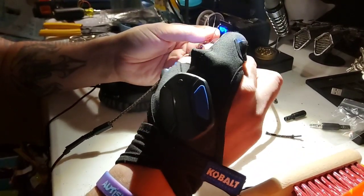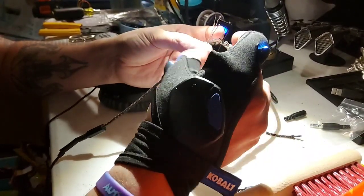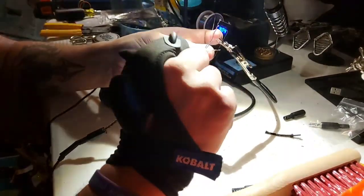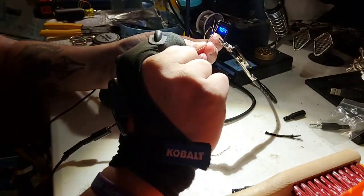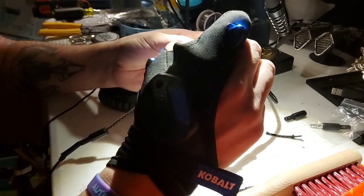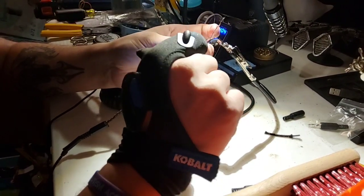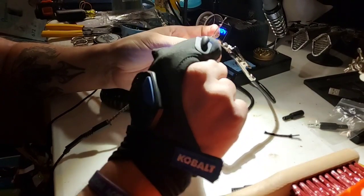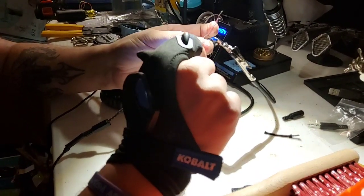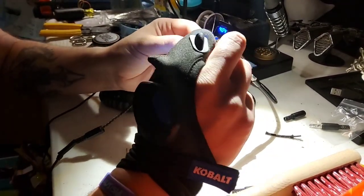So the microphone ground, I actually had this wired backwards. This is also why I had to redo this. Microphone and microphone ground, I would think that the microphone would be on the white wire and the microphone ground would be the bare copper wire here. And it is actually backwards of that. This needs to be grounded here. This white wire is part of the ground, and then the copper needs to go to the mic, or to the shielding or the casing part. So I had to redo that anyway. Again, trial and error a little bit.